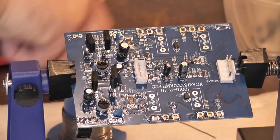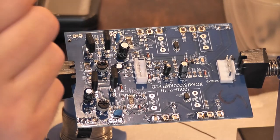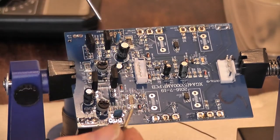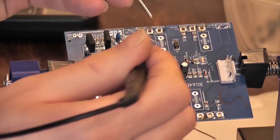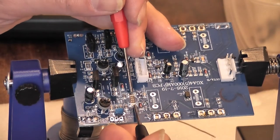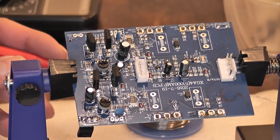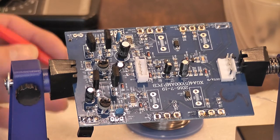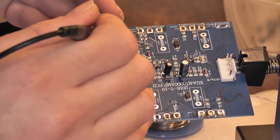I'm fairly certain that was all of them. I don't think we had any of these 220s up here that had gone. This one hasn't taken as bad a hit. I'm almost tempted just out of curiosity to put those driver transistors back in - they're measuring bang on 100 - just to see if it works. But there's a lot of faffing around for nothing really. These 5k6s - like I say, I think the first amp took the brunt and nearly finished the fuse off by the time this one decided to go.